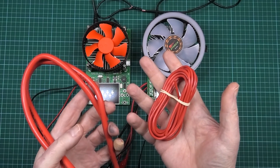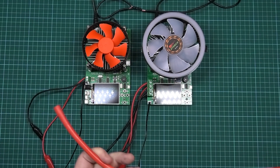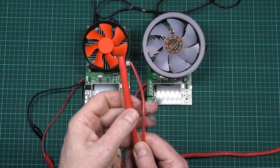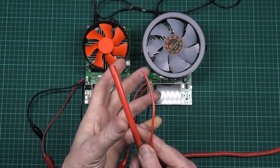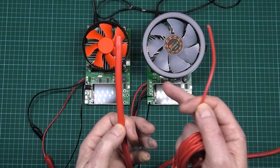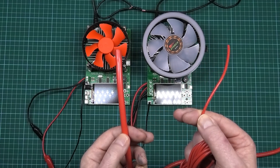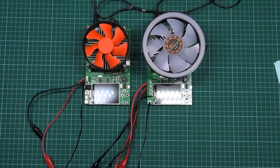These two thicknesses of wire — if we've got 72 volts going into that and 72 volts going into that, these are completely separate circuits. If I was to draw 10 amps through that, the output will be about 70 volts on the thick wire, but only about 40 volts on the thin wire. This thinner one would get hot; the thicker one wouldn't.